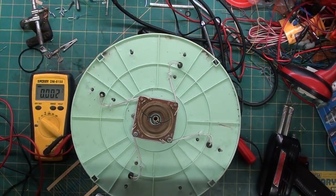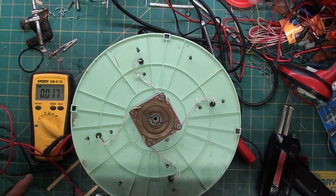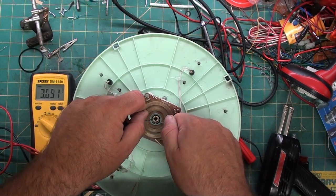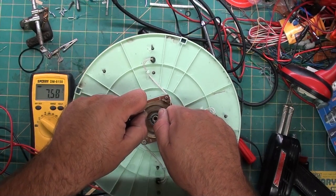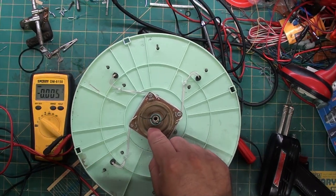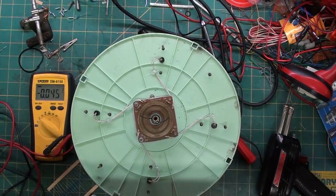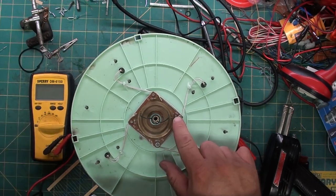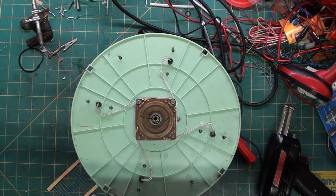Alright, back together. Now what we need to do is figure out to turn these into LEDs, what the power is, and how much resistance we need to add. So, about 7.5, 7.6 volts coming out. This side's hot, which this inner track is the hot. The outer track is the ground or negative. It's important for LEDs. You can't reverse polarity on them. So, these resistors are 10 ohm resistors. If I put an LED in line with that, they will pop the LEDs. It's not enough resistance.